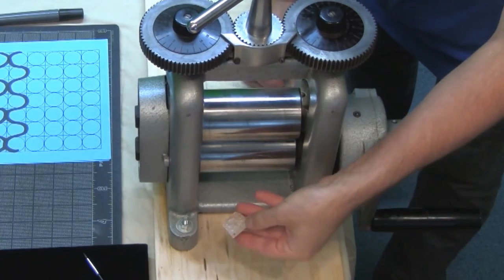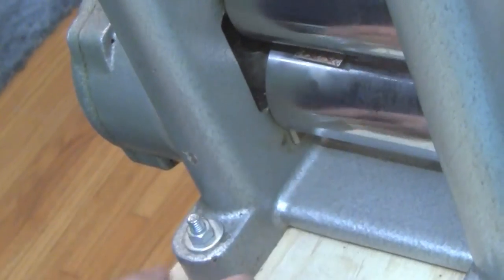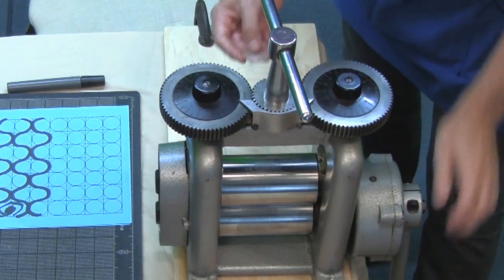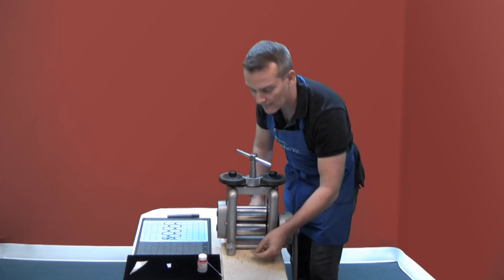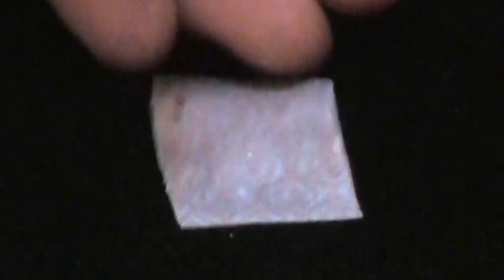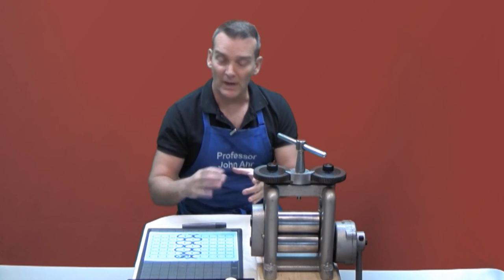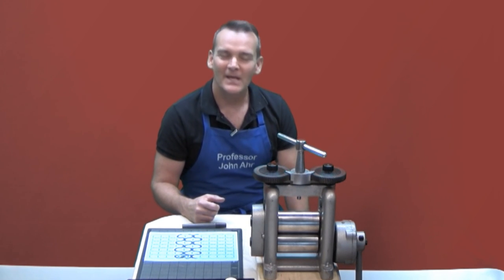Remember you're trying to make the surface smooth and all on the same plane. I'm not giving you exact instructions on how to manipulate the roller settings because every piece is going to be different. We can run the piece through the mill multiple times without a problem because we're only decreasing the distance between the rollers in very small increments and our piece is really well annealed because it's been sweat soldered. With that final roll you can see the material is now all one surface — this enables you to use this piece of metal as an element that you can either treat as a stone by doming it in a dapping block or cutting into it and soldering it around a piece to add extra interest to the surface area. I hope you have fun creating bicolored metal with the rolling mill. Check out our other videos and products on the onlinejewelryacademy.com — thanks for watching.